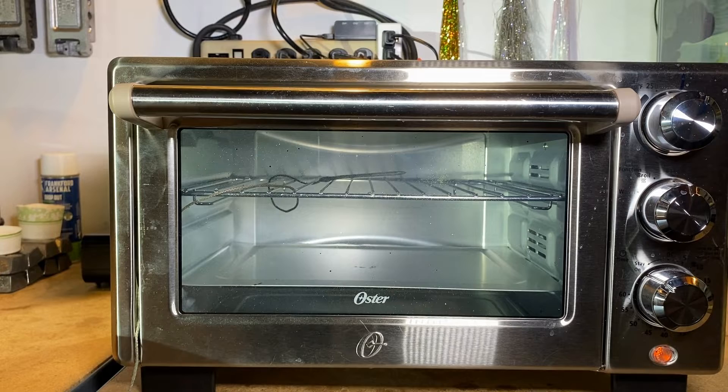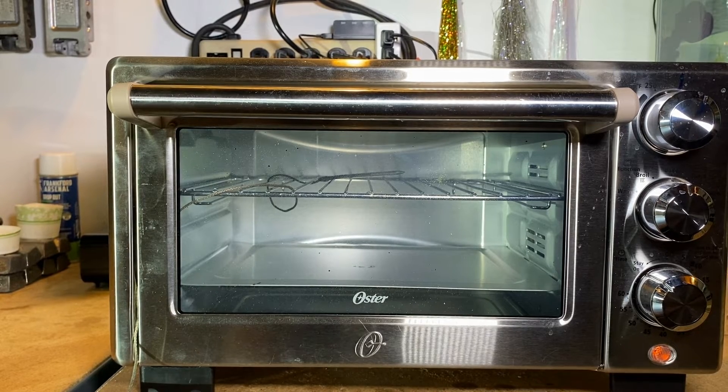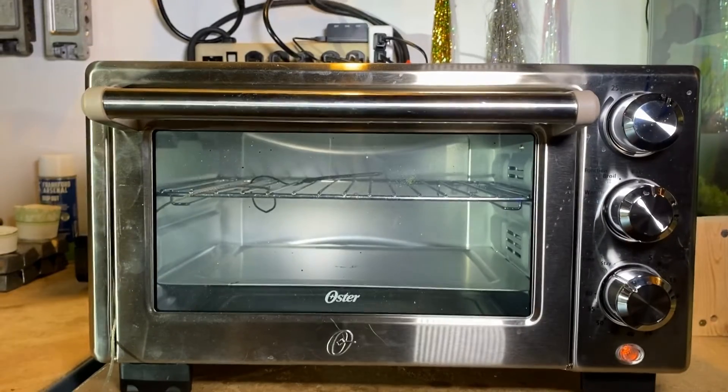Regardless, the paint is made to cure at 350°F for 20 minutes, so if it's too hot for too long it'll start to sag. As I stand here it's showing 421 — so again, a 70-degree difference between what's really going on inside and what the dial says. For me, I dial it back to about 300, maybe even just a little below 300, to get that perfect sweet spot.